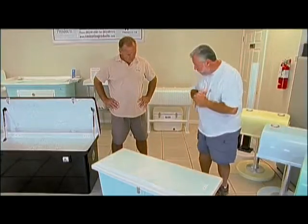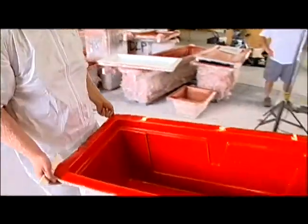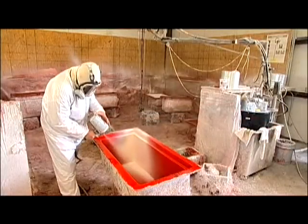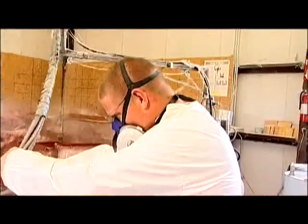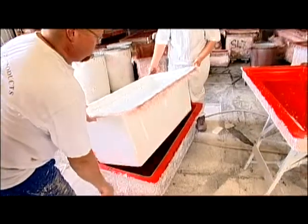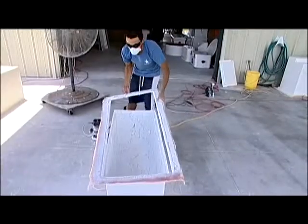So you could two-tone this thing. The manufacturing shop is back behind us and we're here in your showroom. What's the process — how do you build a fiberglass dock box? You've seen us do plugs and molds. You start with your mold, all prepared, and you shoot the gel coat in there — that's the color we pick. We gel coat it first, let it dry, then lay the fiberglass up in there. Once it's cured, you pull it out of the mold. There's a sacrificial flange that helps pull it out, we get that trimmed, and then it goes to assembly.